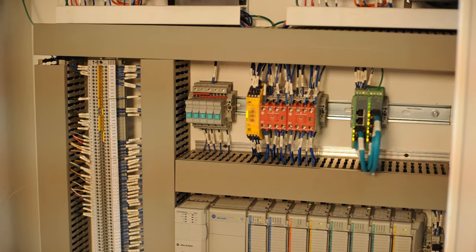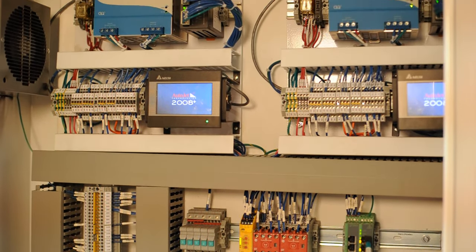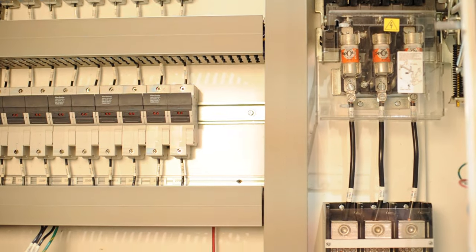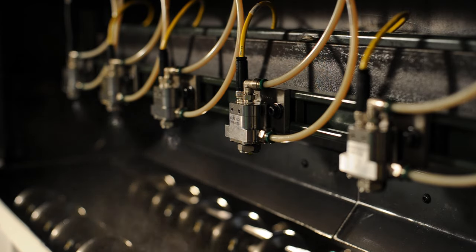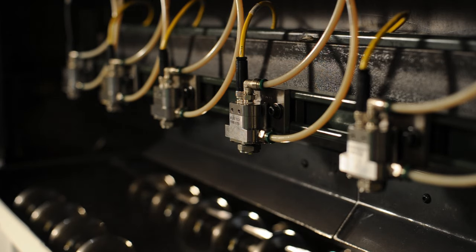Atlas build quality shows up throughout the entire oiler — mechanically, controls piping, electrical and panel construction. Testing indicates that the Gen2 Flexoiler will save thousands of dollars per year spent on fluid, aspiration maintenance and housekeeping. This is achieved by an improvement in fluid transfer rate: 90% for pulse width modulation versus 50% for air atomized nozzles.